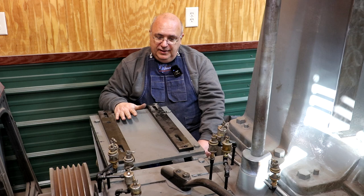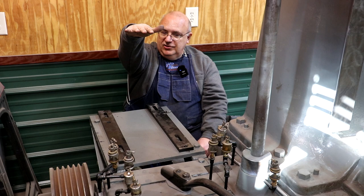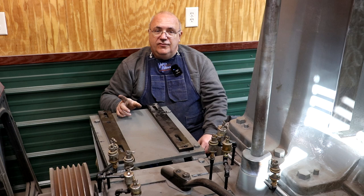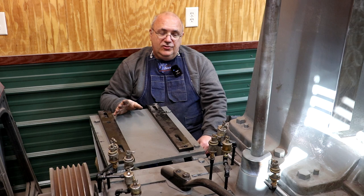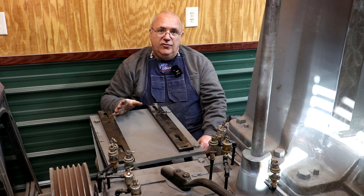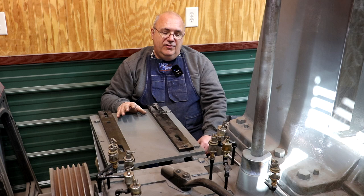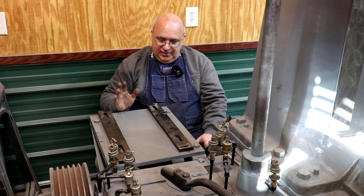The motor I'm using is much, much smaller. You can see by the footprint — that original motor stood probably this high and this wide, it was gigantic. Also, let me mention: yes, the original motor was wired for 440 volts. The previous owner was running it on 220, and I ran it on 220 as well. You can run a 440-volt motor on 220 volts — it will work — but you're not going to be running at full RPMs and not at full horsepower. You're losing a lot of speed and power, and it's generally just not good for the motor. Not recommended.